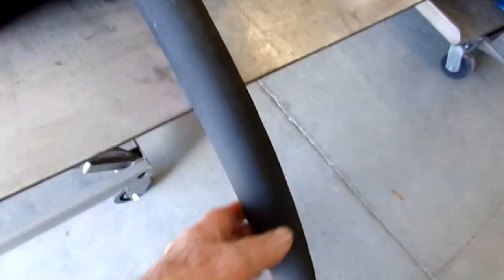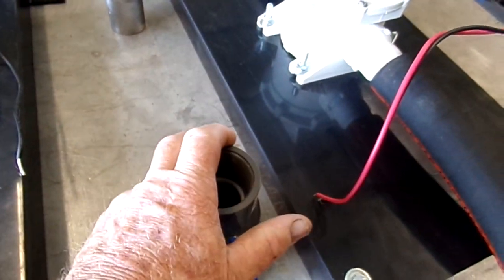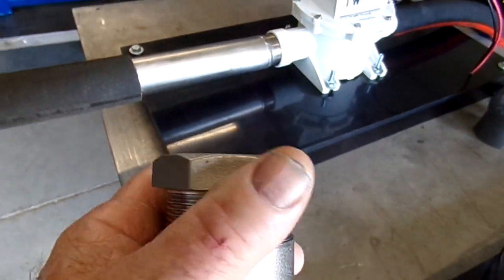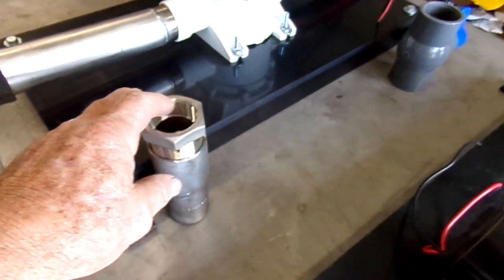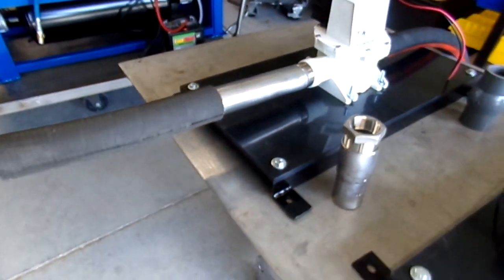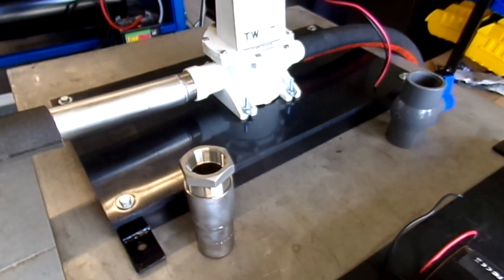The clamps will go on a barb, and the barb will go on this drain ball valve here. We've got all stainless connections, with a reducer bushing going down to one-and-a-quarter inch, which allows you to make the connection depending on the size of your tank. We'll accommodate a one-and-a-half or a one-and-a-quarter — either way, you tell us what you've got and we'll make it happen.